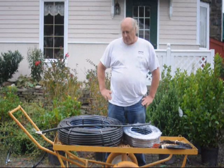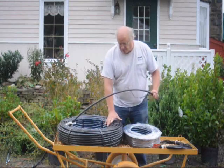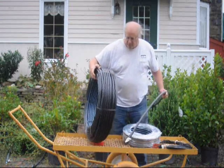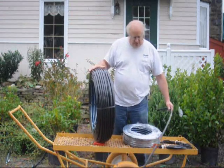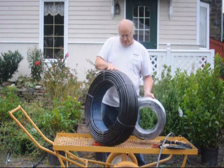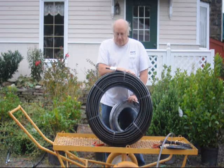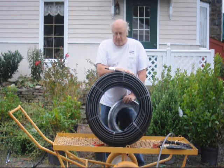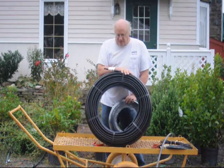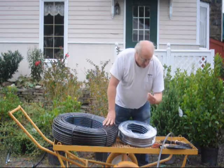This is Bill. I'm at Highland Hill Farm and I want to talk to you today about our pipe that we have for irrigation. We have a thin-walled pipe right here. This comes in 500-foot lengths and we also have it in 100-foot lengths. This pipe is 45 mil — 16 millimeter inside diameter. It's not a standard pipe, but it does fit on half-inch couplers.